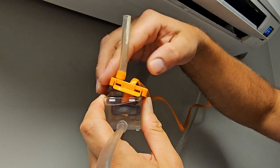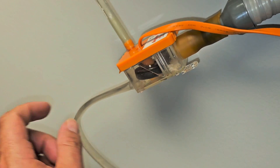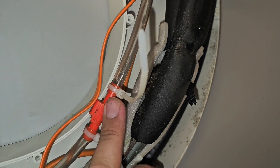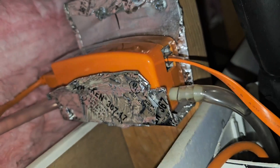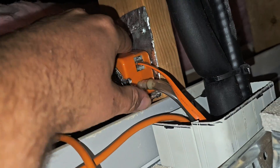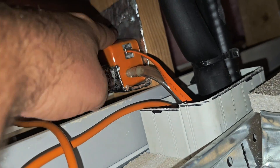Now I'm going to show you where the pump is located. The drain tube from the condensate pan in the indoor wall-mount air handler comes into the reservoir. This is the outlet port for the reservoir — it has a quarter-inch tube that goes up into an anti-siphoning device right here, then leaves that device and goes into the actual pump. This is the pump, and this is the signal cable — it looks like a Cat 5 cable. On the other side we've got power for that pump and the tube which exits to the exterior. Make sure there are no kinks, and use some type of anti-vibration material such as putty or rubber underneath the pump to prevent excess vibration or noise.